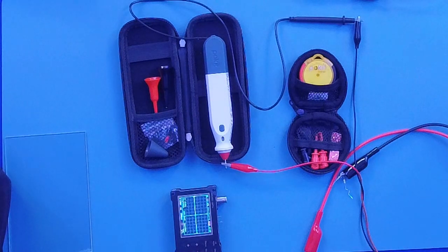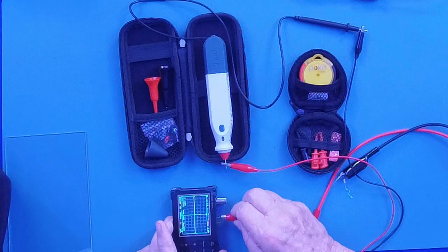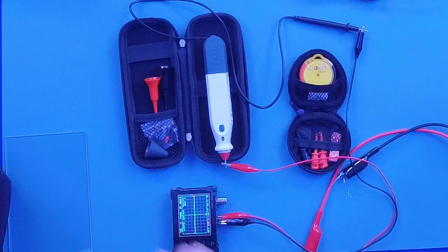and I'm going to go in here and connect to it, and I'm going to go to the oscilloscope, and I am going to tie my signal injector to this, and this is on an iPad. I'm going to hit the trigger. And right now I have the trigger set for continuous capture, whatever you want to call it. So you can see it going through there. I can change that trigger from a free run to a forced so that I can literally go, okay, I just turn that off. Oops. Got several settings.